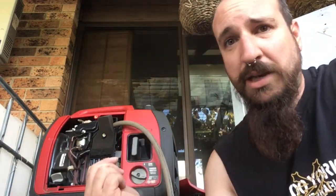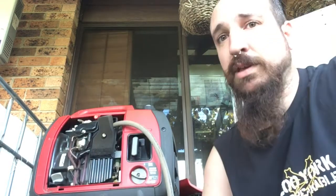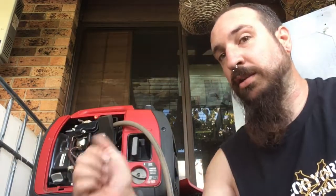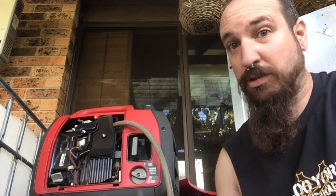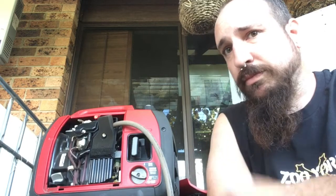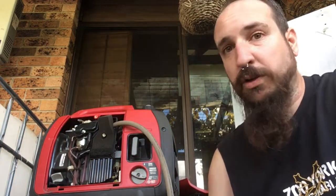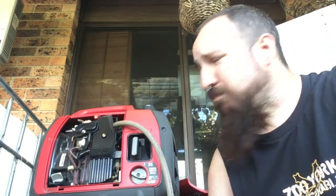So with this you're charging your battery bank — you plug a battery charger into the AC socket, connect it to your battery bank, and charge. I tried this with some lights and fans and it's fine. I put a kettle on it and as soon as I turned the kettle on, bang, it just turned off — I think it's the surge, the overload. It's not big enough to run a kettle. The kettle is about two and a half kilowatts and when it surges this is only 2200 watts. You can probably run a TV or a small fridge. It works.